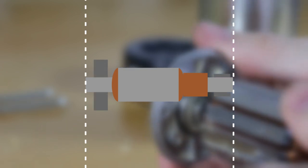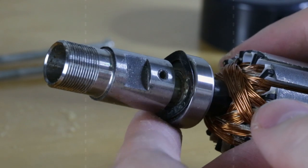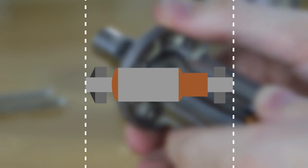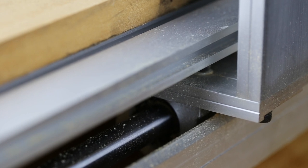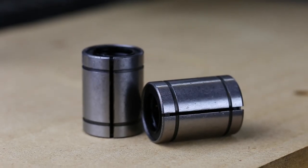The roller bearing can actually serve double duty. As the shaft heats up it's going to want to expand, and if there's a roller bearing on the comm end and the ball bearing press fit into the drive end, then the shaft can expand inside the motor, leaving the tool at the same z-height because the shaft is free to move axially in the roller bearing. This spindle accounts for any shaft movement or tolerance with a wave spring on the drive end, but the problem is that any shaft expansion or downforce from the tool is going to decrease your z-height. Realistically that change is going to be far less than whatever play there is in the cheap Y-linear bearings, but I bought some adjustable bearings to replace those soon and I'll put a link in the description.